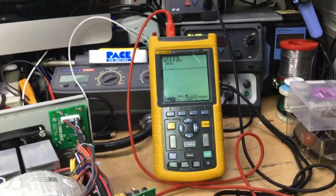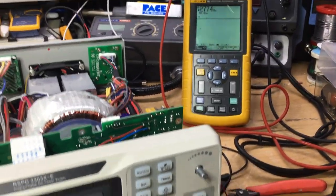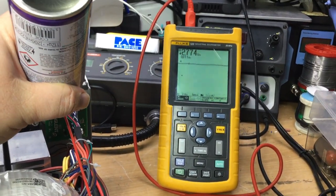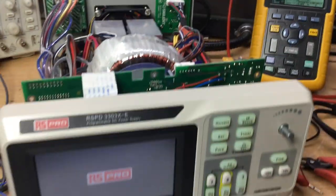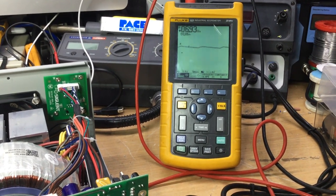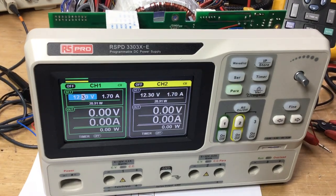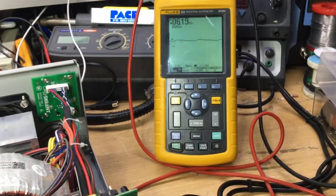Okay, so while it's like that and it's held at 2.7 volts and refusing to power on, if I just spray some circuit freezer then. There we are. And it's coming back up. So then we're back to 7 volts, whatever, it's cold. So once you take out that thermal runaway that it's in, then we're back to square one. Until it obviously heats up again and then starts to decline, which it's doing now.